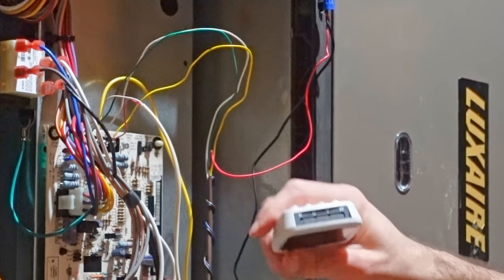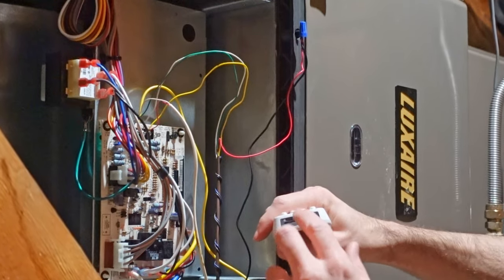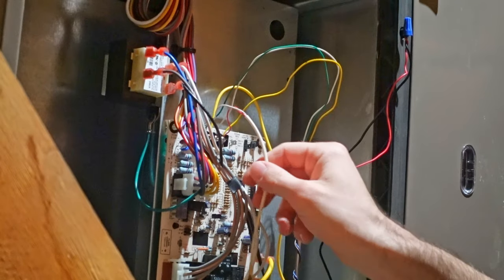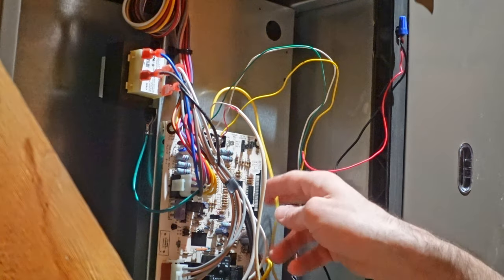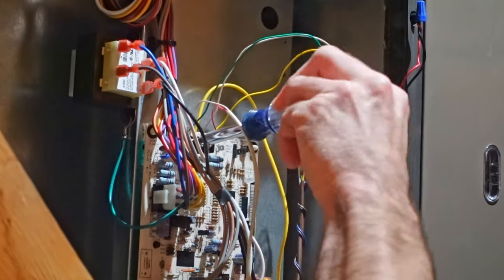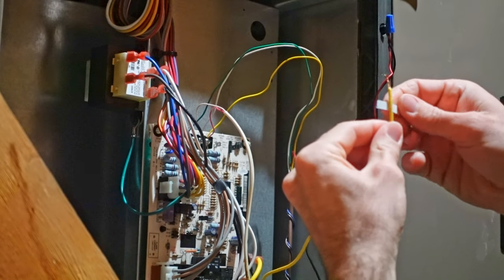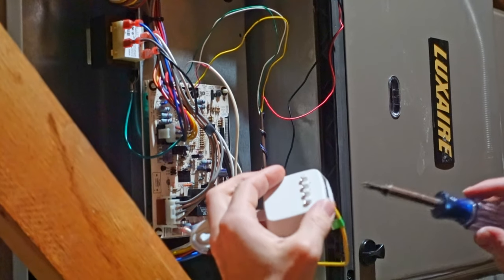What I need to do is undo my R terminal, my G, my Y, and my W. So I'm going to be undoing those three corresponding colors and my new red, and they're all going to be plugged into the PEK. Then I will take the other end and plug the corresponding colors into their corresponding terminals. This kit comes with a nice little peel-off sticker. I'm going to peel off the R label and label this wire my red. With my R wire installed and labeled, I'm going to continue down the line. My next one is going to be the green wire — I'm not going to label it because the color matches the corresponding terminal.